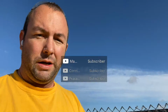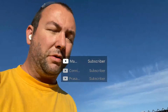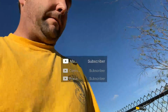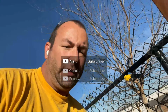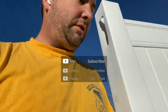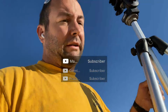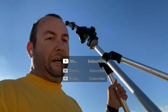The key to all of this is having everything here and ready. I found that is huge. If you can have the water ready and the concrete ready, you can just bust through it. Especially if you have the measurement. So in this case, if you're using these, I believe these are 6 by 8 foot panels, then the 93 inches should work. But just double check. If you know all that going in, it'll make it really helpful. And then you can just attack it and get as many done as possible.